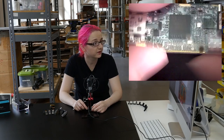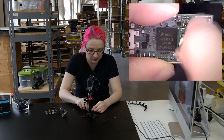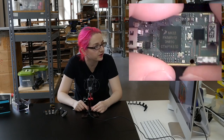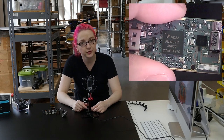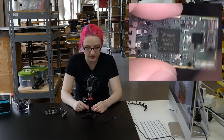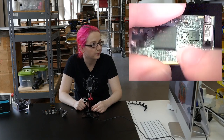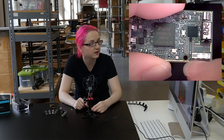There's a crystal over here for this BGA processor. This actually had a little metal cap and we pulled that off with hot air, and underneath is our favorite — the NRF51822. This is the Bluetooth Low Energy transceiver plus processor, a Cortex M0 all in one from Nordic Semi. You can see this really nice ground stitching over here with the balun, and then a ceramic antenna coming right off of it.